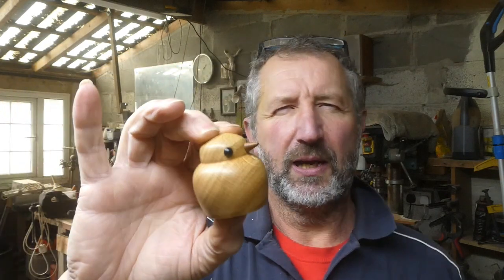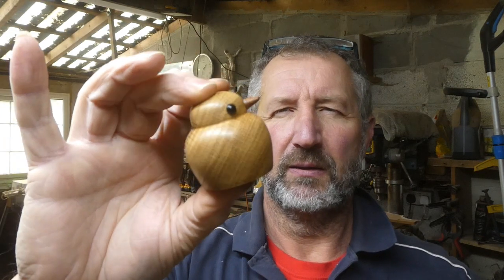It's a really, really simple beginning project — nothing complicated about it, a really easy turn. The beak is also easy to do, especially using the little spanner to create that 4mm dowel. You drill a 4mm hole in the face, and the 4mm spanner gives you the perfect tenon or dowel to slot into the hole — a nice tight, snug fit.